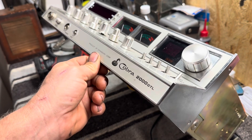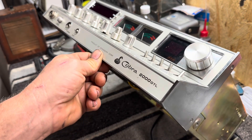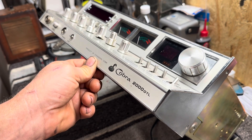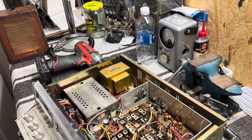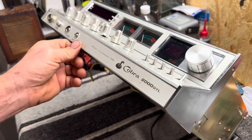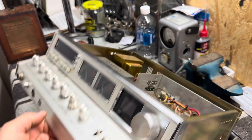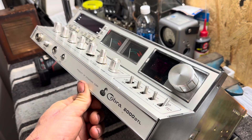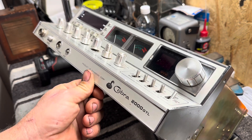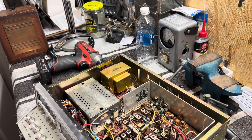It was brought to me by a man who had the radio on outside on his mobile — a large mobile radio — and it was keying up. He came back inside, realized his radio was on and it was receiving that large signal, being really close to his antenna. What's weird is it actually receives — you can hear people talk — but there's no RF output. It doesn't move the meters; it switches over to 'on air' like you're keying up, but there's no output.